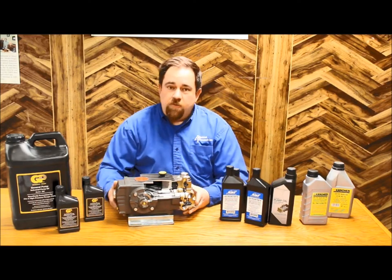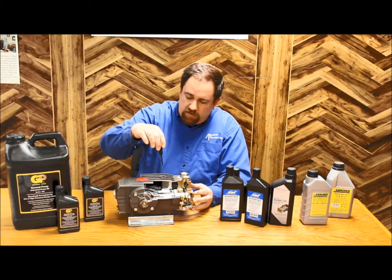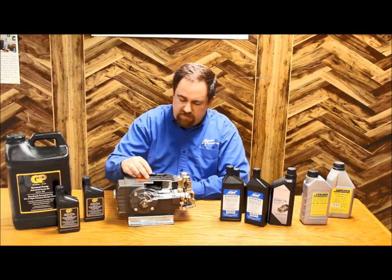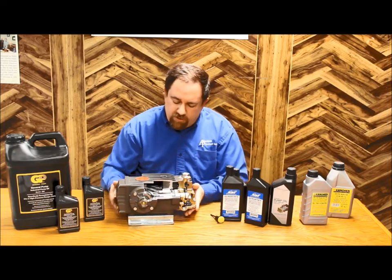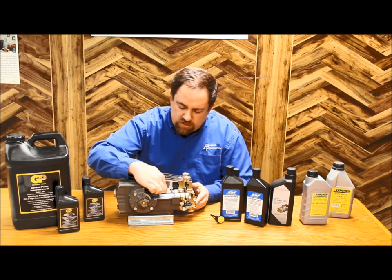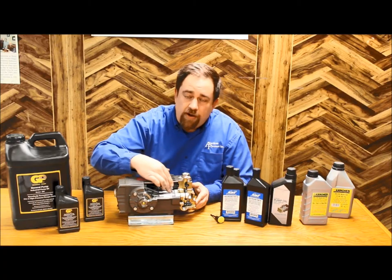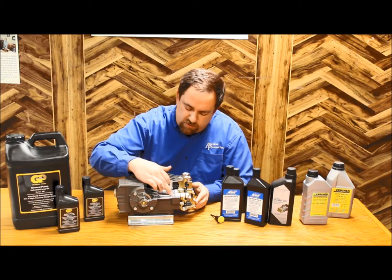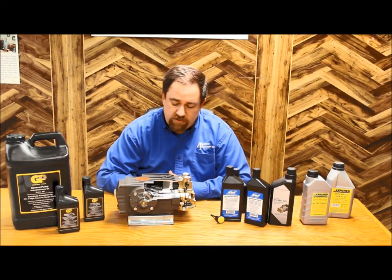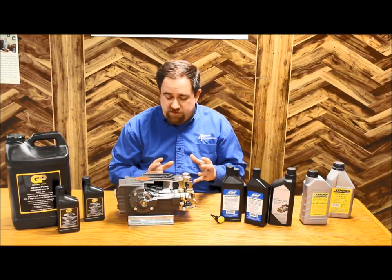I get the question once in a while too: what happens if you fill the pump too full of oil? A few things can happen. One, you could start to get oil coming through the vented oil cap, and that can make a little mess on the top. But the real mechanical reason you don't want to fill the pump too full is to do with the oil seals. This area has good lubrication, and if it were fully submerged in oil, there would be no air to let expansion and movement happen, so you could damage that oil seal or cause oil leaks. One question to ask yourself if you've got a failed oil seal is, did you put too much oil into the pump? That can give you premature oil seal failure and damage those things.